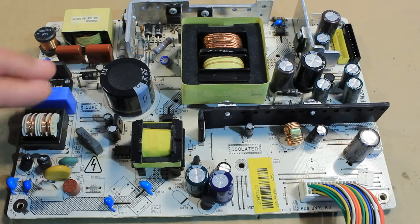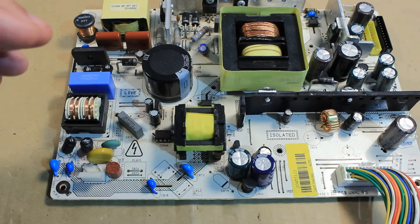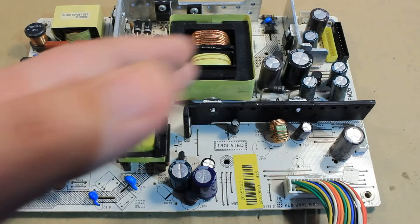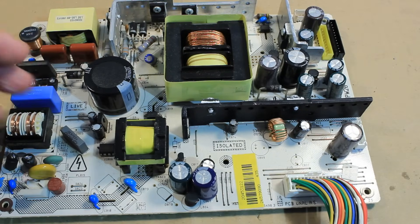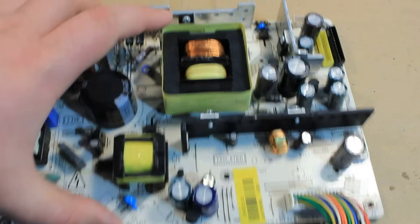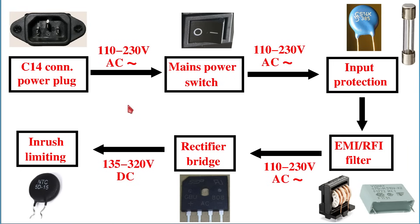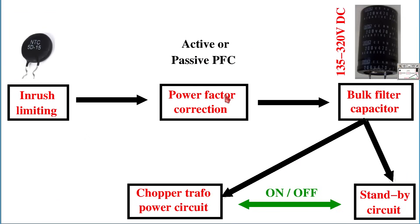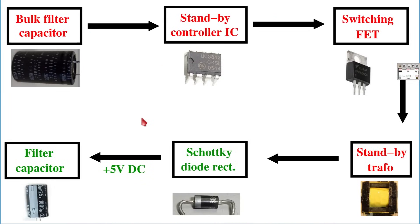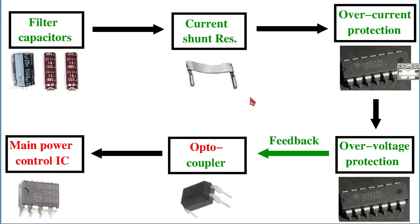This is why in this series I will go step by step and explain the actual functionality of what these things are doing, because one of the main parts of a repair is being able to narrow down which part of the board could be defective. To do that we first need a very basic understanding of what the individual building blocks are, or how a block diagram for such a power supply would look like. Instead of jumping right into a block diagram, I've prepared some slides showing the most important components in a switch mode power supply and how these components tie together.